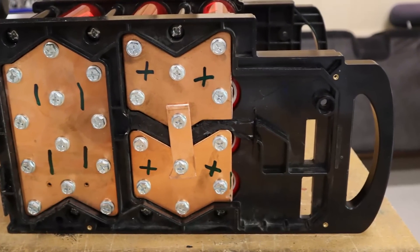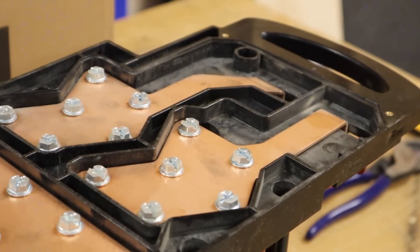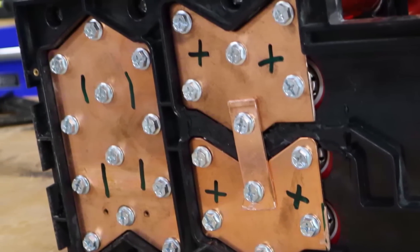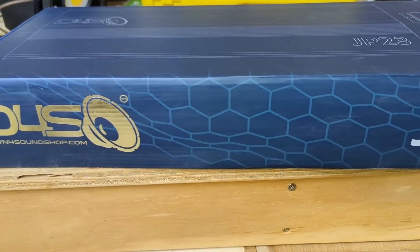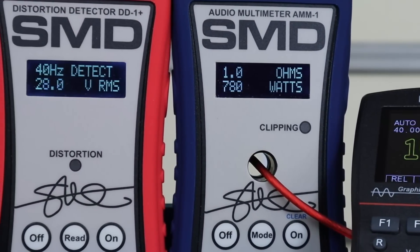In this shot here you can see where I added the jumper. I saved the other copper dog ear so I can add a second jumper if I need to. Comparing this to the original configuration: in the original configuration, the two smaller bus bars were each a different polarity; in this setup they're both positive and the larger copper one is now your negative terminal. It's time for the million dollar question: can this big battery support a big amplifier? To find out, hit the subscribe button and ring the bell so you don't miss my next video. I'm the DIY Audio Guy and I will see you on the next adventure.